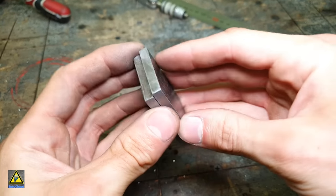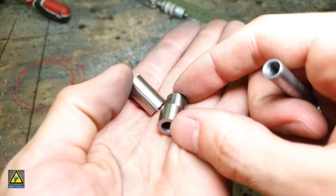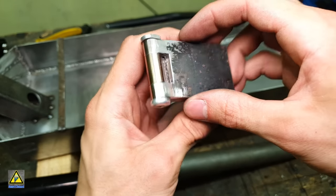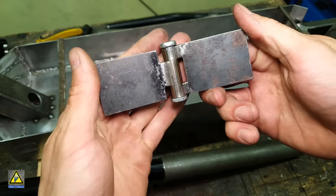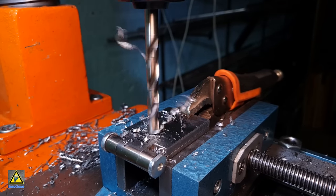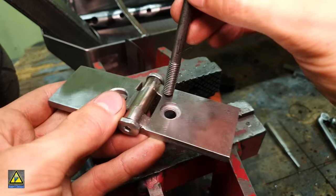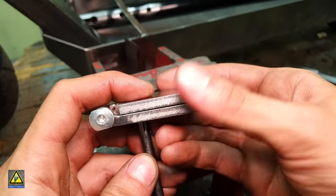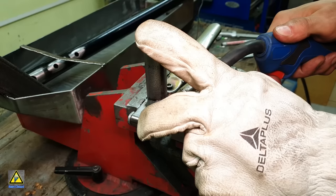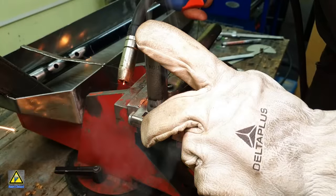I decided to make the hinge for the steering column folding mechanism from 6mm steel plates and three bushings. Getting ahead of myself, I want to say that this design turned out to be not strong enough for the loads experienced by this assembly. The hinge width in my case is 40mm, which I consider too little. I drill the hole for the safety bolt. I countersink the hole. Then I used the stock handlebar tube from the cheap bicycle — my inner voice told me that for a reliable assembly, the entire steering column should be designed and made from scratch rather than modifying parts from a low-quality bike.